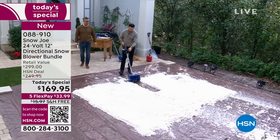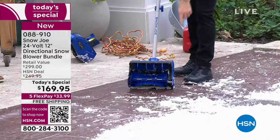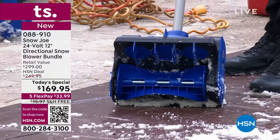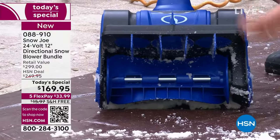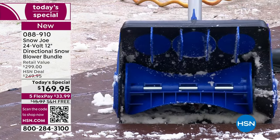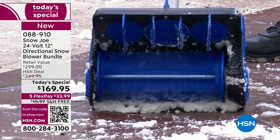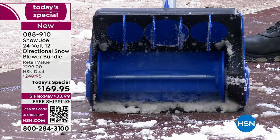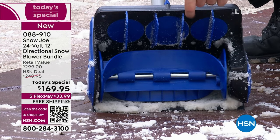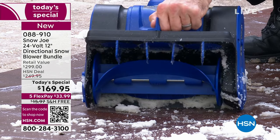Look how far it's shooting — over 20 feet. Comparing models, most popular units we sell are 10 or 11 inches wide — we give you another inch so you have a full foot across left to right. Six inches deep, but I just showed you nine inches — you just go layer by layer. Those are running at over 2,700 revolutions per minute. It's a dual-bladed paddle auger — snow gets sucked in, bounces off the back kickboard and shoots out in whichever direction you choose.